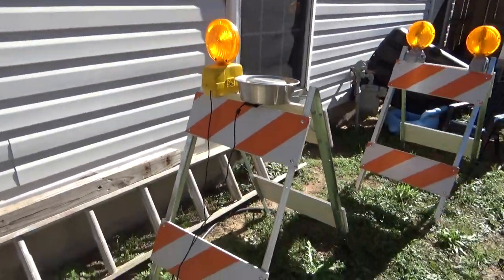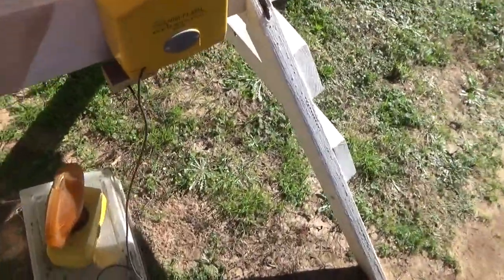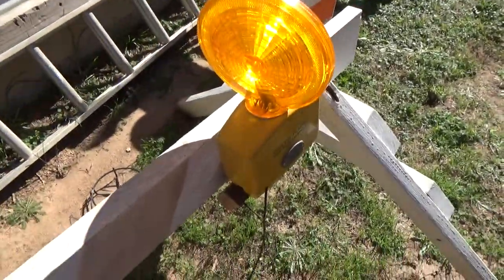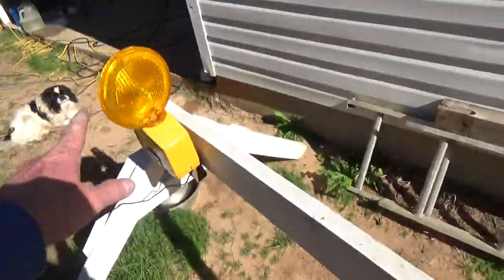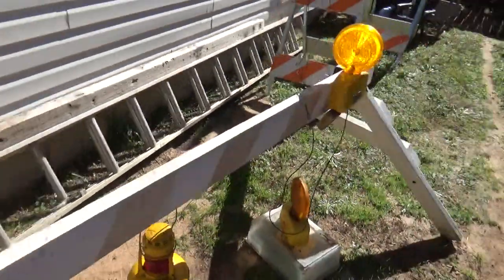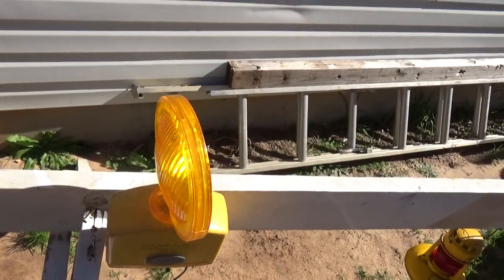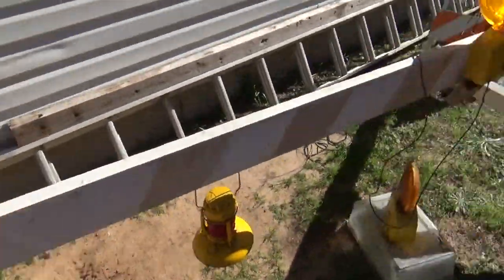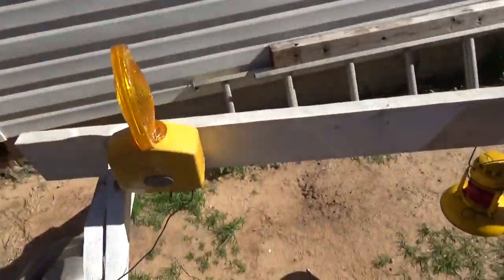Here's a Visi Flash 650, which I've rigged up the same way with a USB cord. This one has an incandescent 1850 bulb. I charged both this one and the LED version at the same time — they don't have a photo cell so they flash continuously. I've got both covered so sun doesn't hit them. The incandescent one gave out faster, and I'm waiting to see how long the LED one will actually stop blinking. It's only running on about five volts.